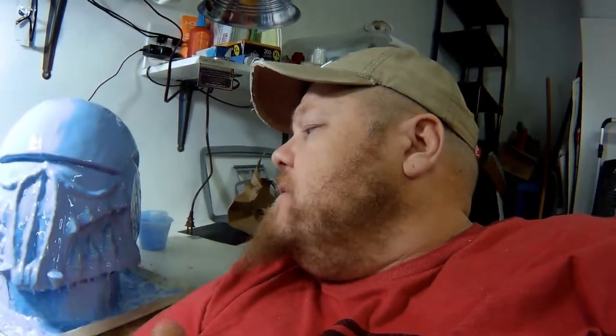Towards the end of the 15 minutes, it gets really thick, it gets kind of pasty and starts really sticking and dragging. So if I have to let it sit for 10 minutes with the thixotropic liquid in it, then that's what I'll do until I get it to that nice little bit thicker than peanut butter paste, so I can paste it into these holes and get it nice and smooth and flat, a surface that I can work with the mother mold.